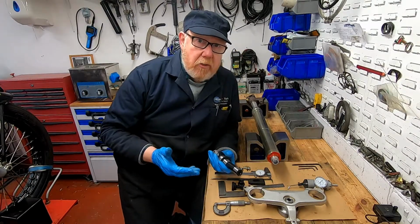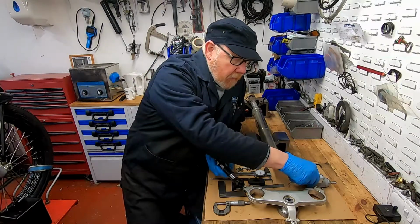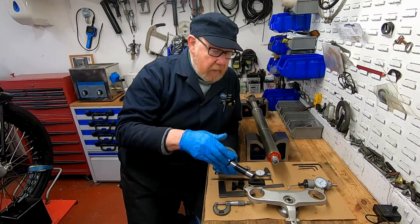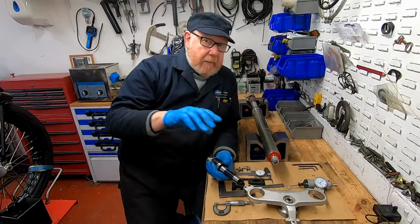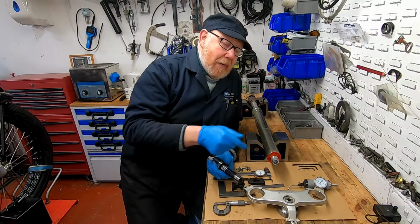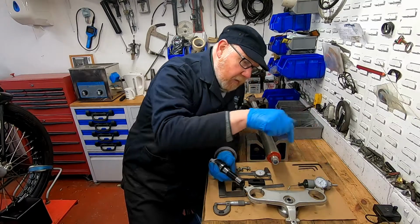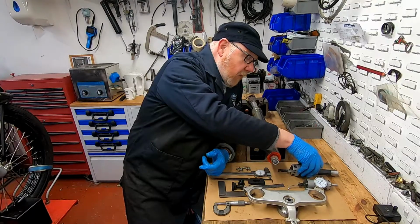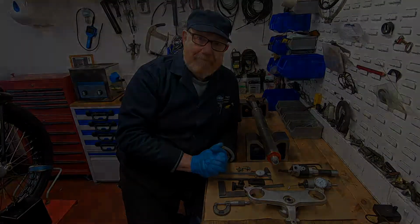The reason I want to do that is I don't want to take out the coaxial indicator and then put in the cutting tool and then take it all down again and re-indicate and then put the cutting tool back in. So I want to indicate both holes, and then I can set the digital readout so that once I've cut this hole, I can go straight back to the direct center line onto that. So that's really the next exercise. So it's over to the milling machine, and we'll get cracking with that.